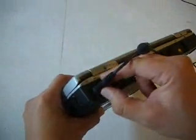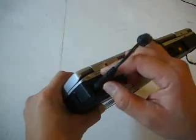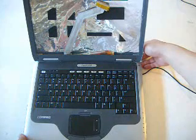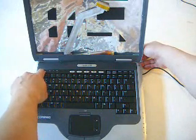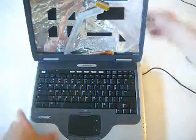The DC inlet is this thing here where the AC adapter jack comes in. If this is a bit wiggly — like in this case — this is a good example of a damaged DC power jack. Sometimes you can tell if it still has connection on the motherboard by putting it on one side and then pushing. This one really needs a power jack replacement.